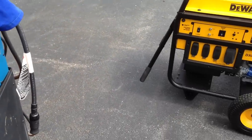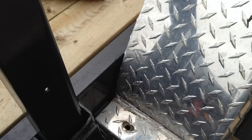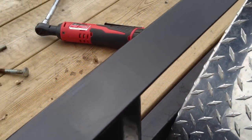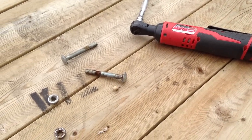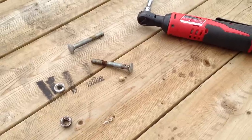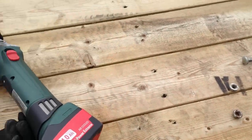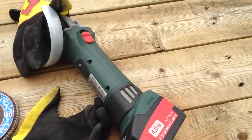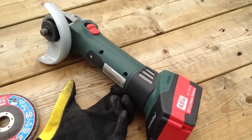The 211 Auto-Set does dual voltage, but we're running it on 220, and since I don't have that in-house, the generator takes care of it. Two bolts hold the fender — we use the Milwaukee M12 ratchet for that. That thing is great; you can just crank on the bolts and rip them right out easily. Then we're going to use the Metabo grinder with a Diablo 60-grit four-and-a-half-inch flap disc.